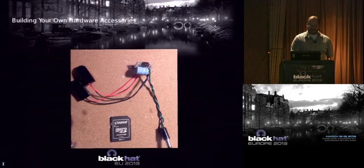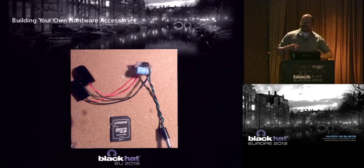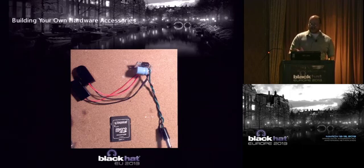All right. Okay. A little bit about building hardware. I've built a couple of things. I've adapted some XBee adapters so that you can connect these little XBee radios to your devices. Also built some simple power supplies, which you guys saw. The simplest one is this guy here. It's two 9-volt battery clips, a 7805 voltage regulator, a smoothing capacitor, and a 2.1 by 5.5 millimeter barrel plug. All right. And you just solder that all together.